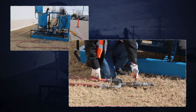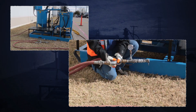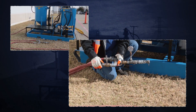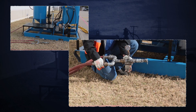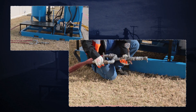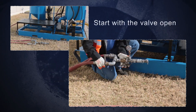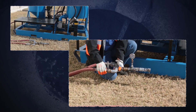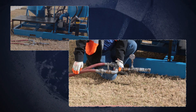In some cases, you may want to be able to limit pressure into the tendon. If working with tendons that require a small volume of grout, it may be difficult to keep pressure low with larger grout plants. The grout comes from the plant through this hose and into the assembly where it splits and either flows into the tendon or recirculates back through this hose into the agitating tank. The valve under the gauge is throttled to increase or decrease the grout flow to the tendon. You want to start with the valve open for the grout flow that goes back into the agitating tank. If you need to send more grout flow into the tendon, you can always close it further, directing more grout into the tendon.